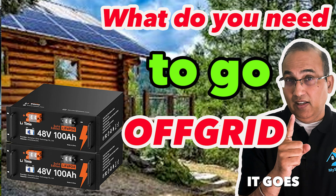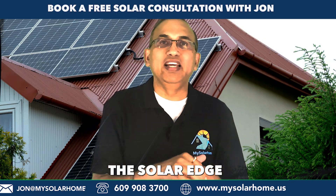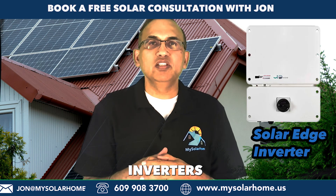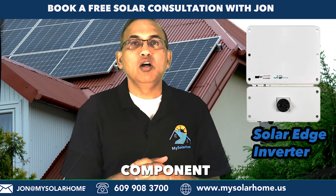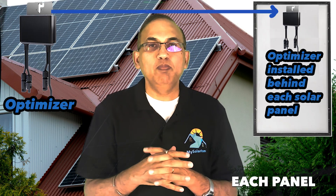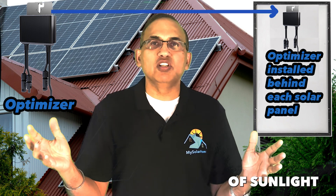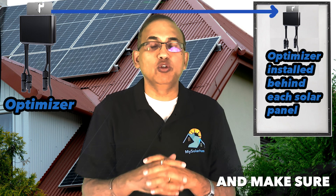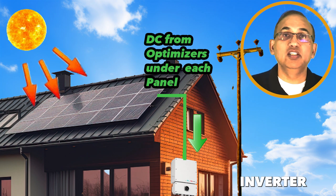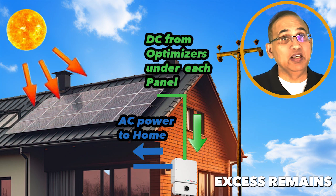I have a video that goes into the actual design of an off-grid system — see the link in my description below. It covers sizing for batteries, what you need, and what kind of inverters. Next, let's look at a grid-tied install. I'll show you both the SolarEdge and Enphase options as they are equally popular. SolarEdge systems have one or more inverters that are wall-mounted on a garage or the side of the home. A small component called the Optimizer goes under each panel. The optimizers ensure that every solar panel produces the maximum amount of DC current possible given the conditions of sunlight and shade, and make sure maximum DC current flows from each panel into the SolarEdge inverter. That inverter converts the DC from the panels to AC for use in the home. After the home uses the power, whatever excess remains is sent to the grid.